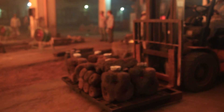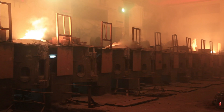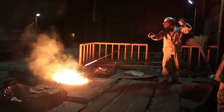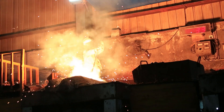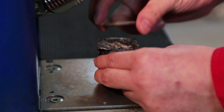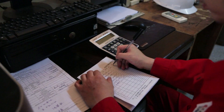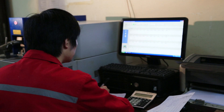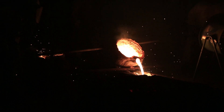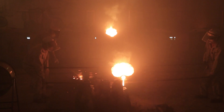Molds are staged by the furnace in preparation for pouring. Each furnace produces a unique heat number and has a unique chemistry makeup. This chemical composition is what you see on our MTR reports. As the melt progresses, chemical analyses are performed by taking a plug from the melt, cooling it, and prepping it for spectrometer analysis. A technician will test the sample and give instructions as to whether the chemistry needs additions or meets specifications. When the chemistry is verified within specification, the metal is allowed to be poured into the waiting molds.